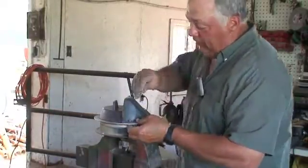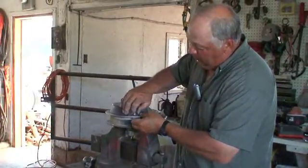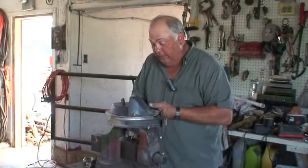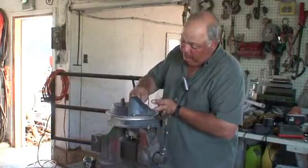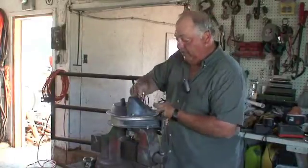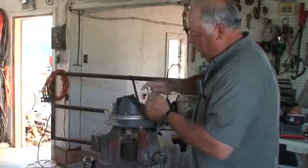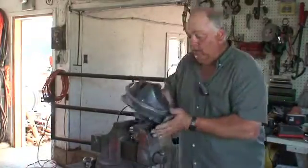It's a fairly quick process — changing these takes roughly about 20-25 minutes a piece to tear them all out and put them in. But using the right finger pickup is definitely worth taking the time to change, because if you want consistent planting, it's worth the extra hour or so it takes to change it over.